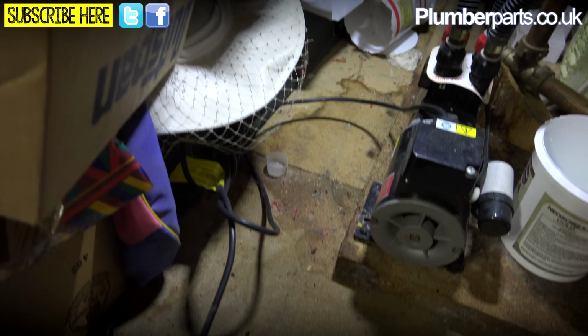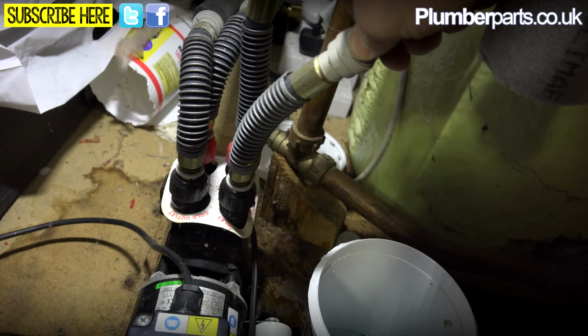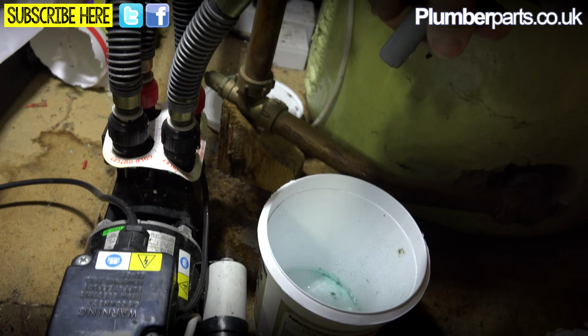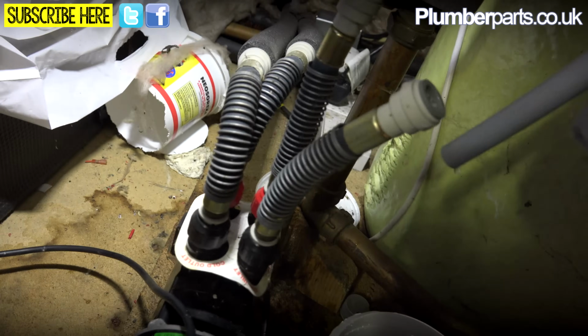Usually they go into a 13 amp fuse spur. We have a cold feed pipe here that we know we've isolated already, so we should just be able to pop this off now. There you go, that's nice and empty, good. We should also be able to do the same with the hot water. Got a little bucket up here, just ready to take any water that might come out. Right, that's great. So now we've got the pipes out for those two there.